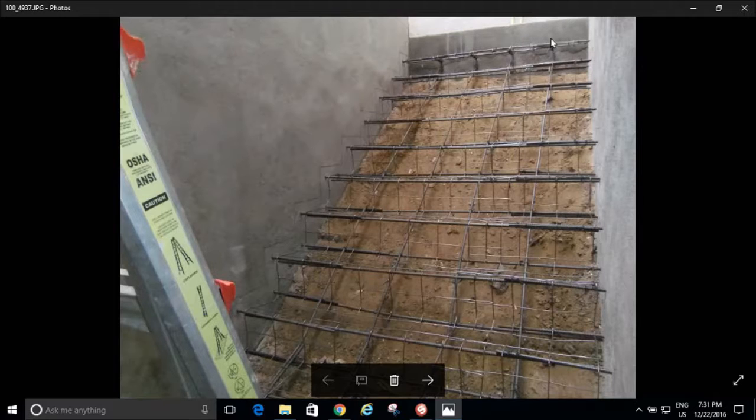But even my platforms are doweled into the retaining walls, because I've seen a lot of substandard concrete work where they'll just dump concrete between the walls and they don't even dowel in or anything. So then what happens is if your sub base settles, then your concrete's going to fall with it. And I don't want that happening, because if that happens, that's major cracks in the concrete.